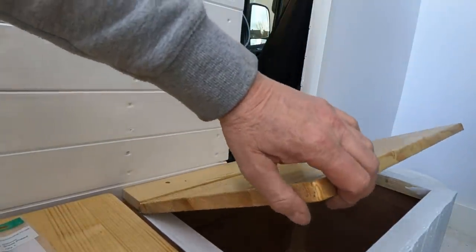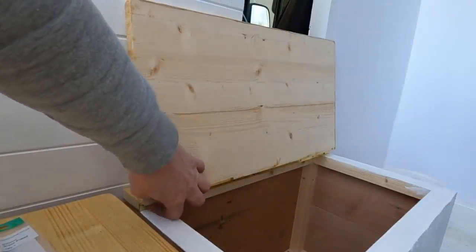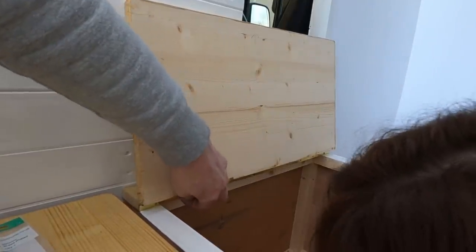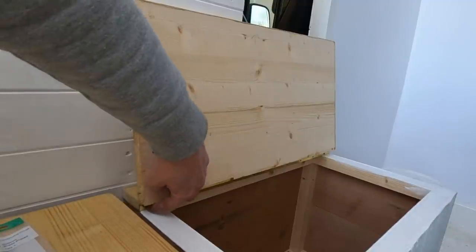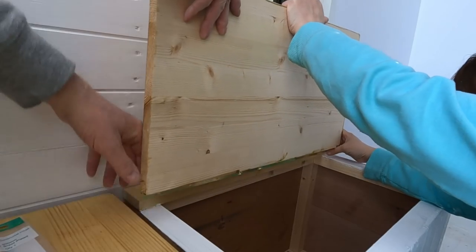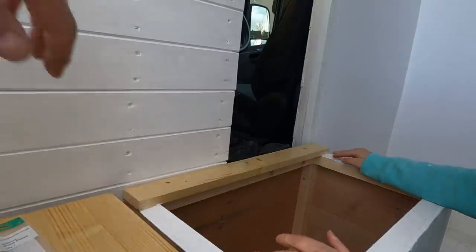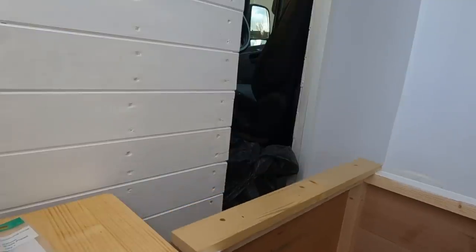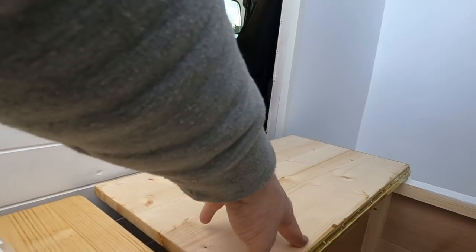It's too low down. — What do you mean too low down? — This is hitting this. — So it needs to lift up a little bit. — So you've got that gap there? There's the gap between the surface of this and the edge of that hinge — that tiny little gap — you need exactly the same gap between the hinge and this. So that has got to come up. — Do I need to put a little spacer then? — A little bit up off of here, move it away from the wall. There's an easy way and a hard way to do everything. Lay that flat on there like that and do them up — that way you've got the clearance gap.